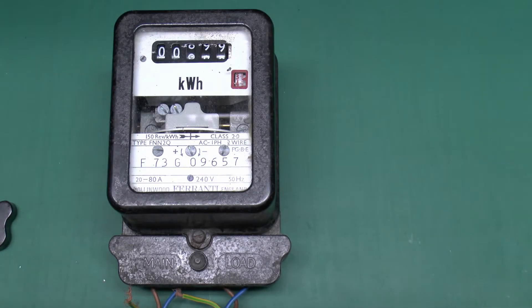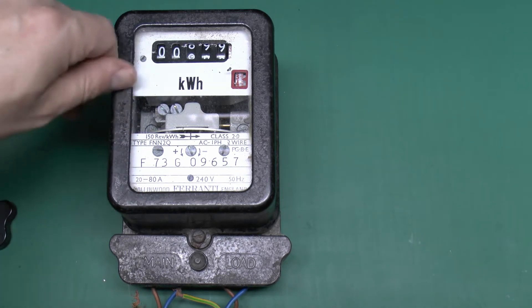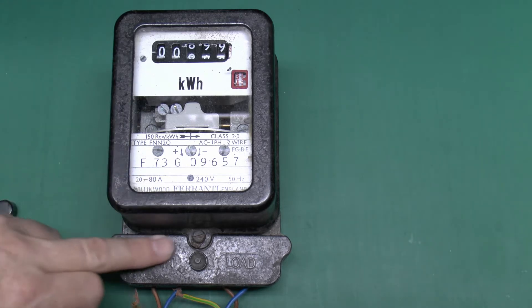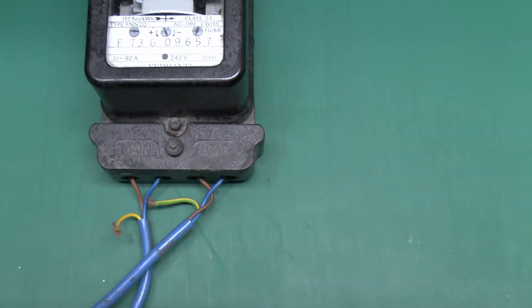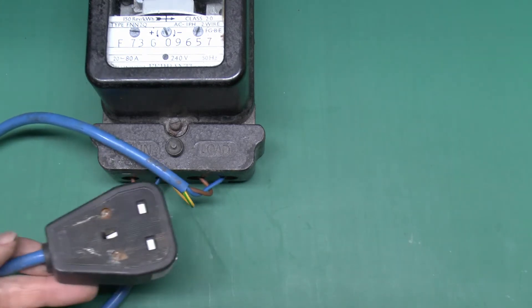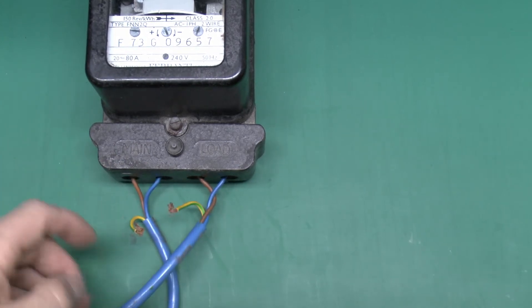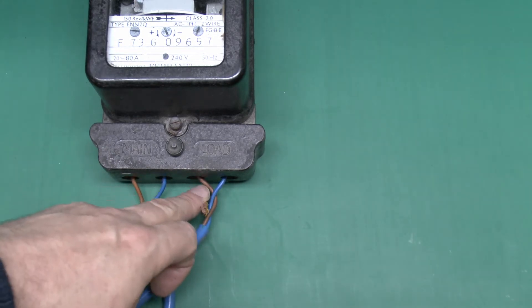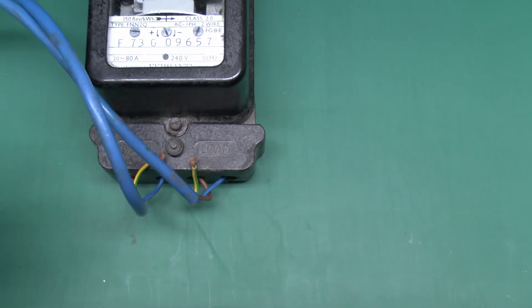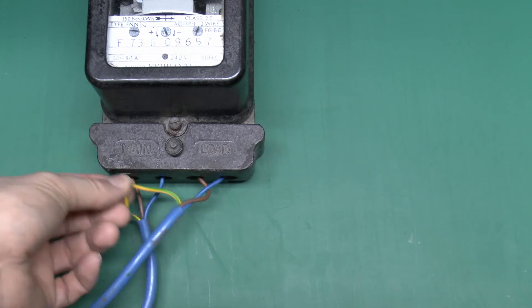This is the other one, which is in a considerably worse state. As you can see it's got this coating on the actual casing — whether that's just general dirt or whatever. It actually came with this wiring attached, which presumably had a plug on it once. That's got a three-pin socket, and whoever's done it has just attempted to twist the earth wires together and they've just fallen apart. And obviously you can see they've reversed polarity here — this is correct, and this is backwards — so whatever they were powering was connected up incorrectly. And of course this wiring is just falling apart. Total disaster.